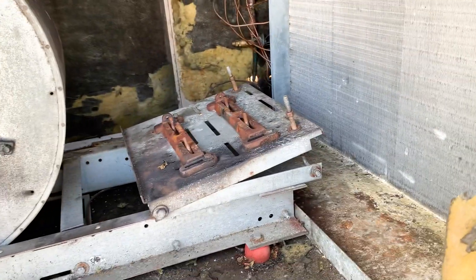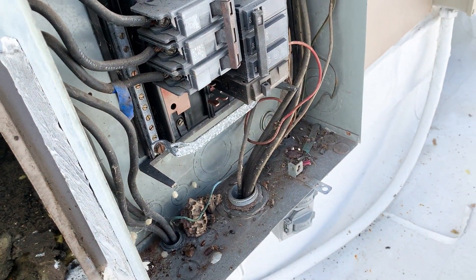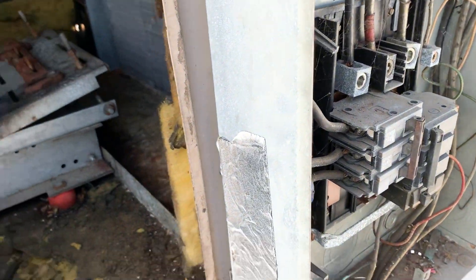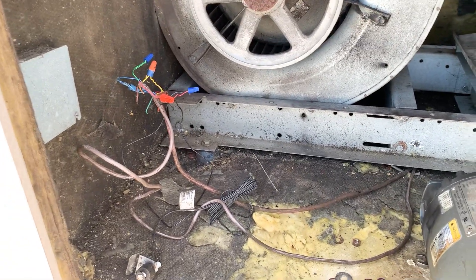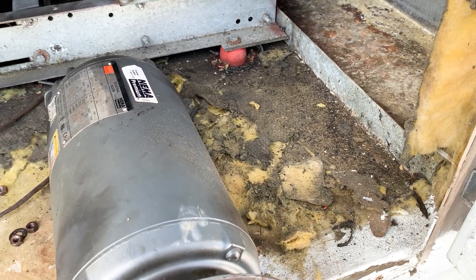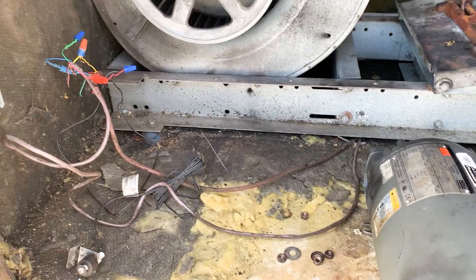The contactor's gone. Motor is unmounted. The breaker is gone. All that wiring's gone. And we're going to rewire all of that. We're going to put the low voltage in a sealed junction box in the bottom here and plug the ends so that it's not getting wrecked by the supply air.